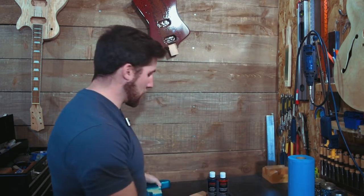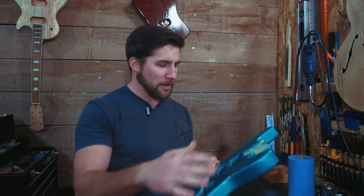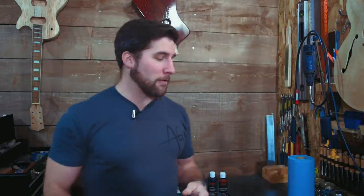The concept here is that you sand with your sandpaper, and as you're going up to your high grits, you actually use polish as well — almost like wet sanding. I have a guitar that most of you will recognize, already polished. This is my Duplicolor one done recently using Calypso Blue with a 2K clear over it. I'm going to scuff it up with 1200 grit, then come in with 1500, 2000, 2500, and 3000, using the Jeskar compound — correcting compound and micro finishing polish. Should be interesting.